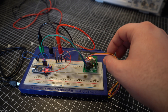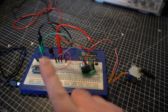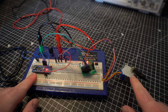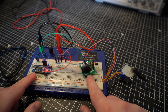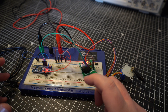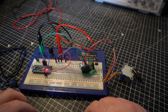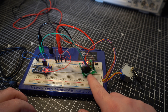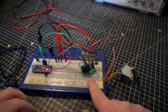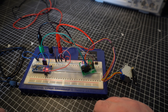That's about it for the wiring. This is basically all the wiring I need: my Arduino which will have the code to track the time and know how many times this motor should revolve and at what speed. The little driver board with the power supply connected handles all the rest of the power requirements. The rest of this project is basically just 3D printing and assembling stuff. If you haven't seen this before, I hope that makes sense. Definitely look up how Darlington transistors work and how stepper motors work, and convince yourself of how they marry together.